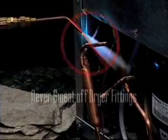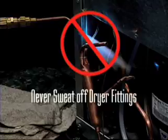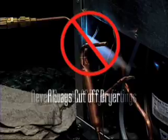Never sweat the dryer off to preserve tubing. Your torch will heat up the desiccant in the dryer. The desiccant will release the moisture that it has absorbed and you'll contaminate the system. Always cut the dryer out of the system.